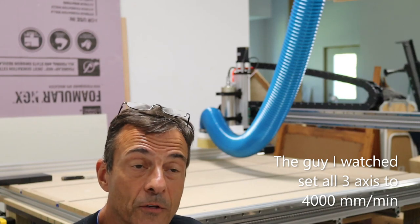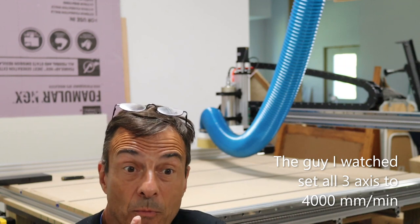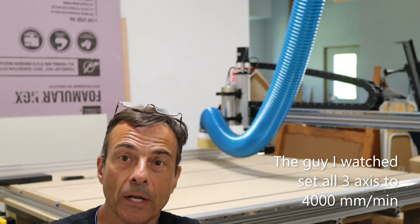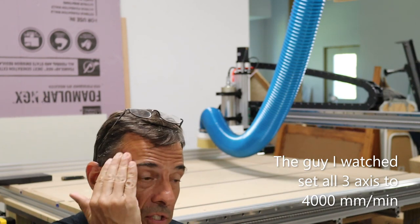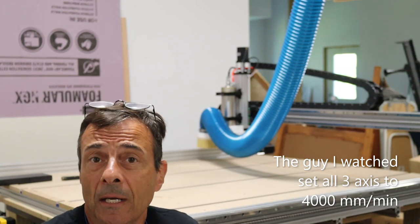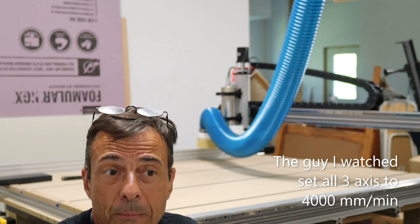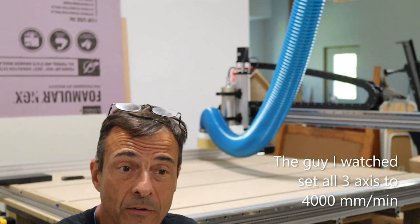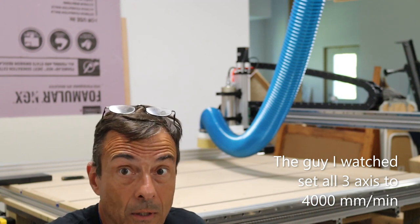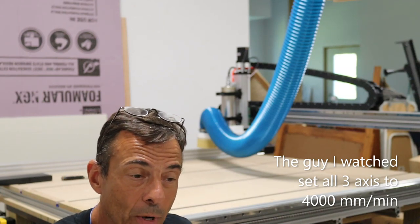It might often drive up in the Z direction at the maximum rate, I guess especially if it's attempting to fully retract. But at any rate, that fixed it. It didn't lose steps, and so when it tried to drive to 5 point whatever millimeters above the stock height, it made it there. And so we were able to finish up the cut.